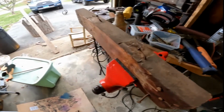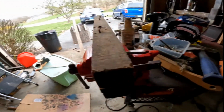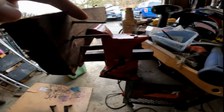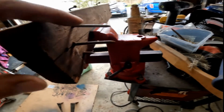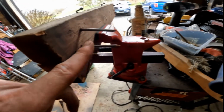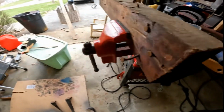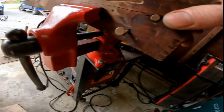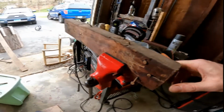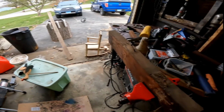So this is the piece of 2x4 that it was hanging off of. So this 2x4 was face nailed into the studs with, you know, these full-size structural framing nails. They're probably 3.5-inch full diameter structural framing nails, but one of them wasn't put in all the way. The board is already cracked, on both sides. There's no real protection from this board getting pulled off.